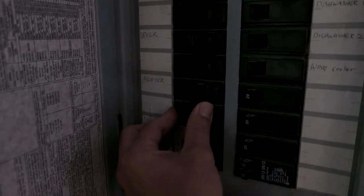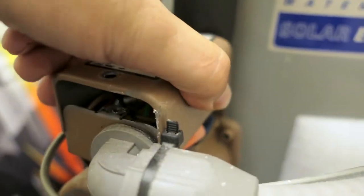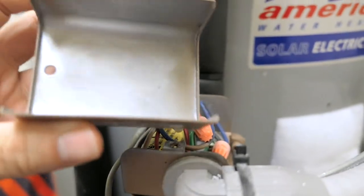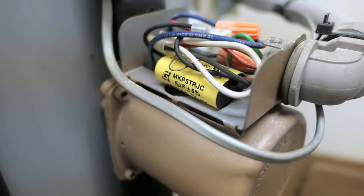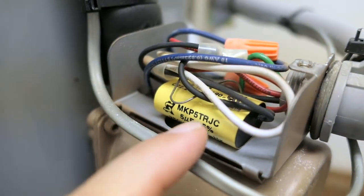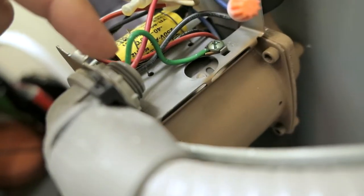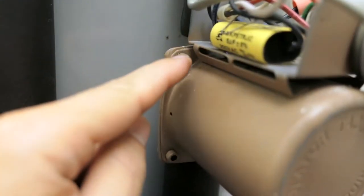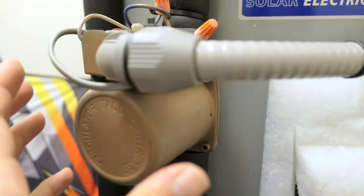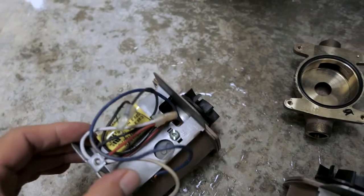We need to go ahead and change it. I'm going to turn it off at the breaker — now there's no more power so we can safely take it apart. All this stuff is super hot so maybe I should wait until it cools down a bit. I can see what looks like a start capacitor there, which makes me wonder if that's the issue, but I have a feeling it's not. I'm going to cut all these wires loose, close the valves on each side to isolate this piece, and then there are four hex bolts and it should just come right out.